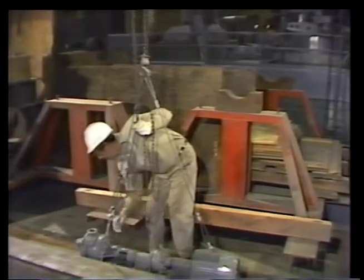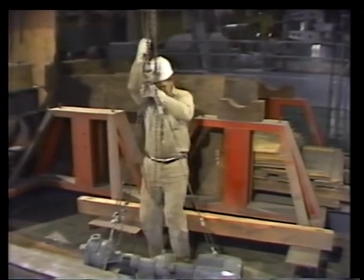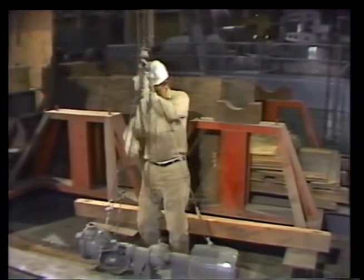As you've seen, there are many different ways to rig loads for lifting. Often, a single load can be lifted with any of several kinds of rigs. So far, we've seen the same load lifted 3 ways: with 3 slings and 2 turnbuckles, with 4 slings and 2 turnbuckles, and as a 2-legged rig with a load leveler. But as far as Norris's main rigging job is concerned, when we left off, he'd leveled the load and was ready to lift. In a minute or two, we'll return to watch the trickiest part of the job: moving the load. But before we go on, take this time to study segment 3 of your text and work the exercises.